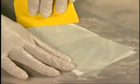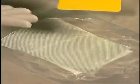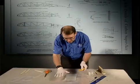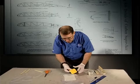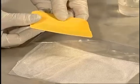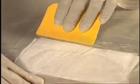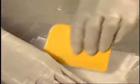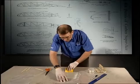You can see this is a very clean process because virtually no resin is escaping — it's all in the bag. There's no resin building up on the squeegee, as you can see. It's all encased in the bag, so it's a great clean way to get glass ready for layup.